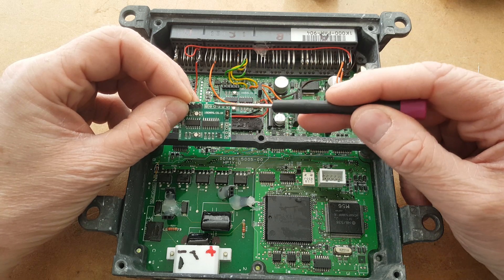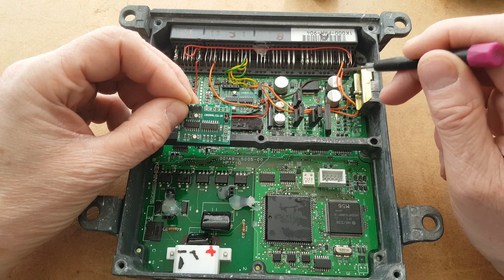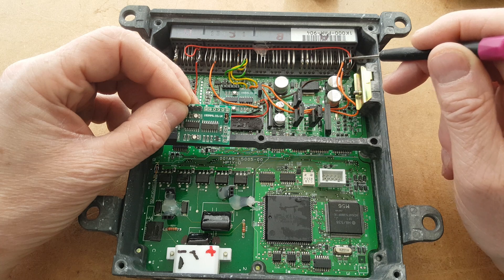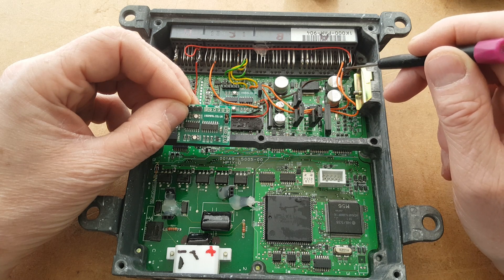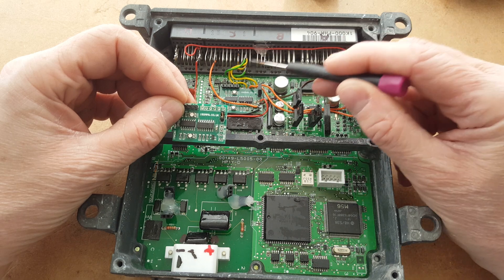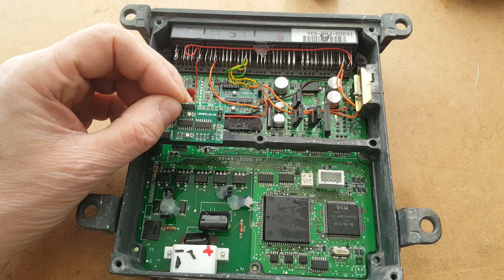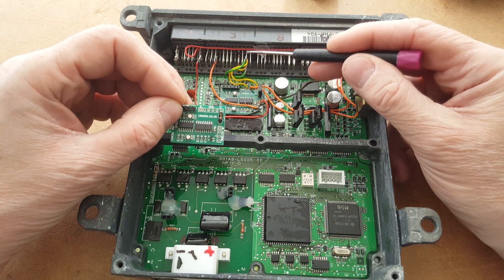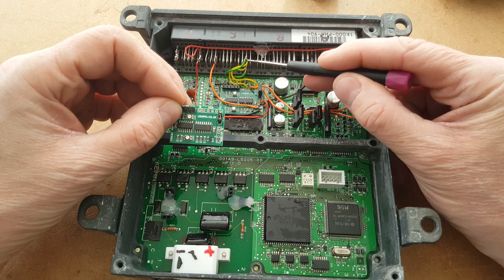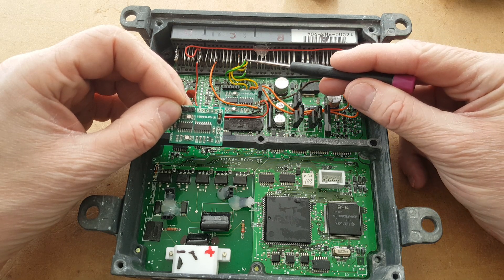For this, we need to cut three pins. We cut this pin here — the third pin in, which is the most accessible — because we're going to connect to both sides of it: the input side coming in and the output side going down into the circuit board. For the other two, we're cutting the outer one and the middle one, which is slightly more difficult to access. You're going to need a fine tip soldering iron and a steady hand. Once you cut the pins, you can bend them up or out a bit to make them more accessible.